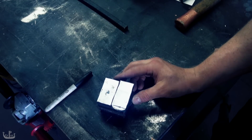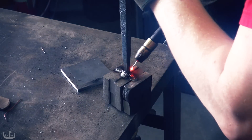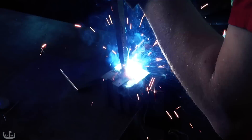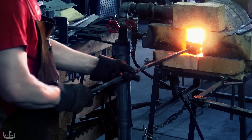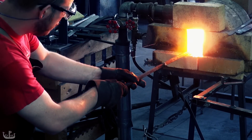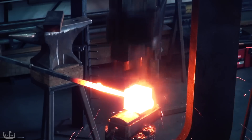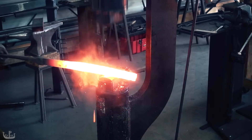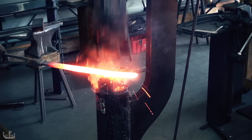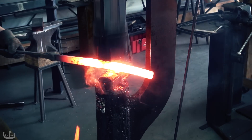Given the cleaned bar, I cut the iron into rectangular pieces that I reassemble two by two while switching grain direction. The interesting question is if the iron will weld completely in the forge. The gap that is side by side cannot be worked directly by the power hammer. However, the iron is very squishy and the hope is that flattening under the hammer will force the gaps to close. We are back to where we were in the previous experiment — the iron needs to be forged into long strips that can be cut and welded again.